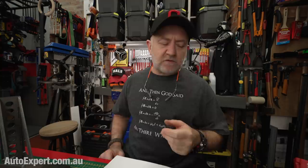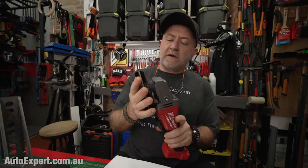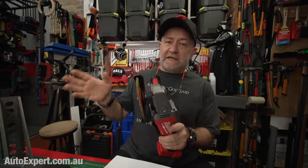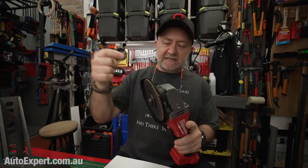My position has not changed, although plenty of you disagreed with me: you should not use gloves when you use a grinder. That's my position on this. I've worked in industry and all the grinders, including all the bench grinders, had big signs on them saying no gloves, because gloves are an entrapment hazard. They can feed your hand into the gap between the disc and the guard, and if that happens it's a real orthopaedic surgery challenge.